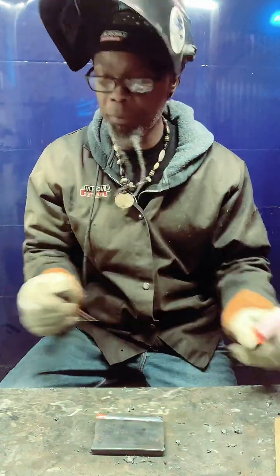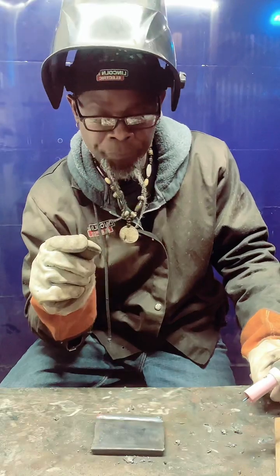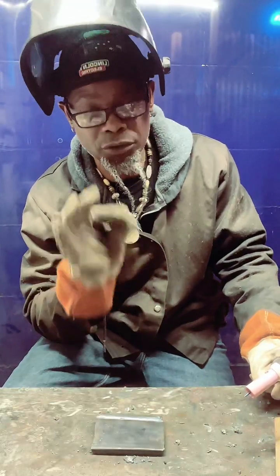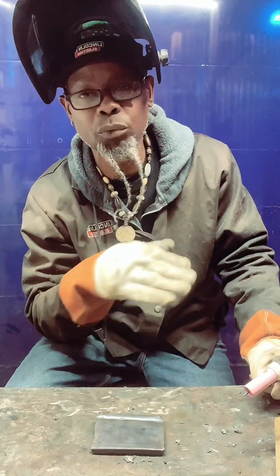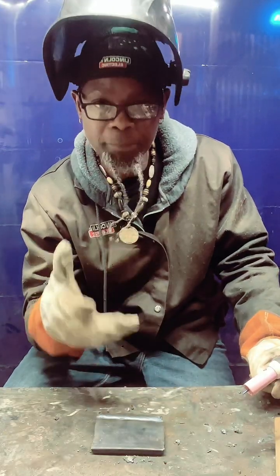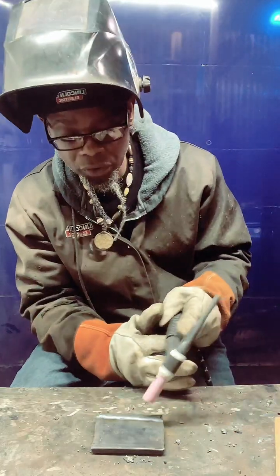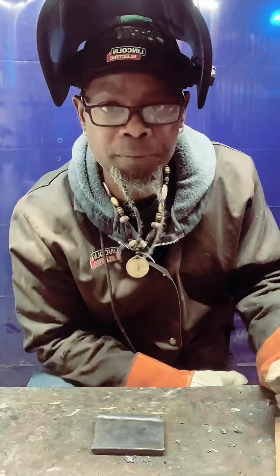So with all welding processes, you want to run your bead on the toe of the previous bead you just ran. That'll help you start keeping it tight. As you learn, you want to learn how to cut welds in half and stack beads. So you might as well practice that in the beginning, and that way you'll really get the concept, because you're going to be burning one and tying into the next one. I'm going to go get these pliers and show y'all this one.